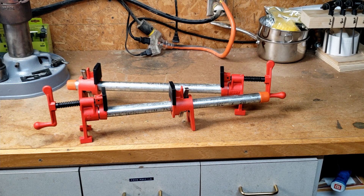To help explain what I mean, let me bring up one more debate in the woodworking community. The clamping pressure debate is fought constantly online, and for a new woodworker it is better to use less clamping pressure as a default. When you are inexperienced, you just don't have a good feel for how much pressure you should apply and when. For example, if you are building a cabinet carcass with half-inch Baltic birch, with a rabbet and a dado or a lap joint, and you want to glue and clamp it all up, you really don't want to be applying thousands of PSI across the carcass — it would bow and snap the plywood. In that case, you are really just holding the joint together while the glue sets, and you could probably just use large elastic bands or a ratchet strap. I have done this exact thing when I ran out of clamps on a big project.